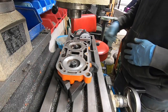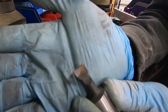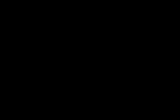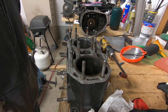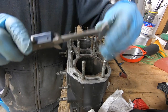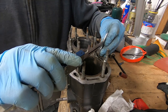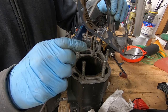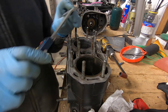I have modified my cutter. I know the camera probably can't pick it up too well, but hopefully this works. In order to figure out how big of a diameter I want the groove to be, I'm going to measure two things: the outside of the sleeve — 86 millimeters — and the inside of the gasket bore, which is 76. And I'll go right in the middle of that.